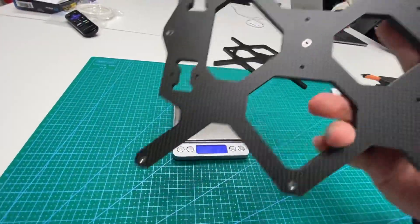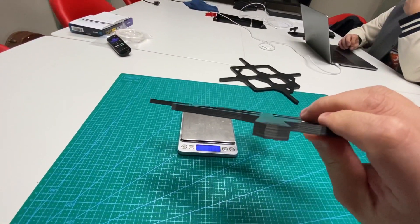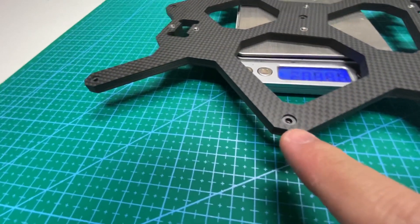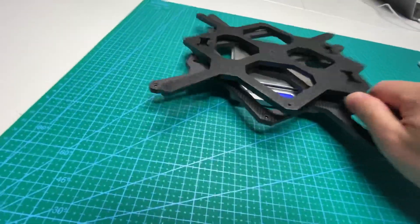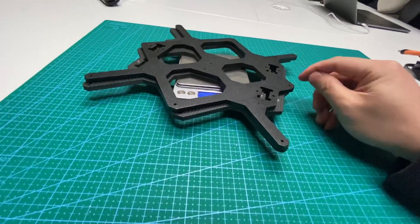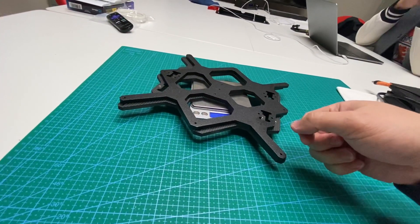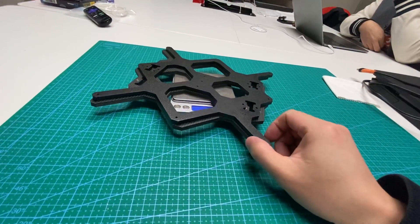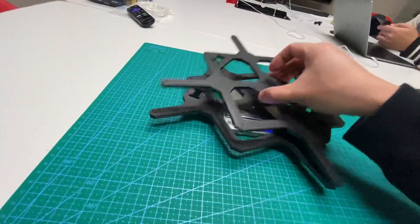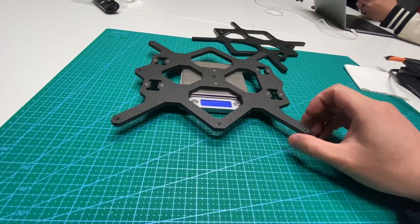For the heat bed mount I also do the same thing, so when you see it, it's all flat inside. The other upgrade for this part is the sinkhole here - I make a little bit of a sinkhole so when you put a standoff it stays secure. Previously when installing the heat bed, you'd put the press nut in, very carefully place the heat bed on top, put the screws in, and any accidental movement would knock a standoff out of position. Now with the sinkholes, all the standoffs can be secured and kept in position to make heat bed installation easy.